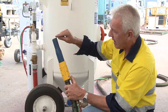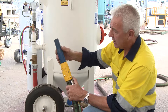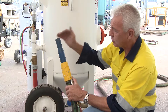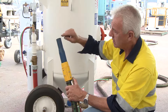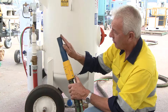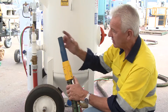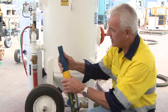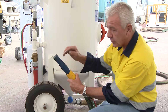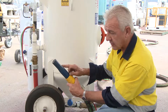If you have too much grit, that mantle diminishes with the amount of abrasive exiting the nozzle. If you have not enough grit, there is no mantle and the nozzle just screams. So in between those two parameters — no mantle and scream — there is a little blue shape that is quite easily defined in appropriate light. Just off scream and just under flooding is the right amount of grit. If you open that valve too far, the noise of the nozzle is softened so it becomes dull and deadened — that again is an indication you've got too much grit.